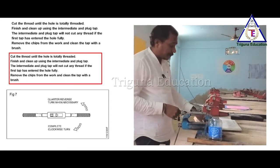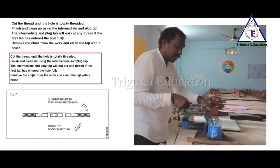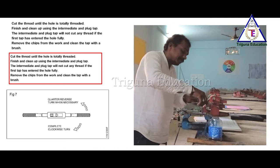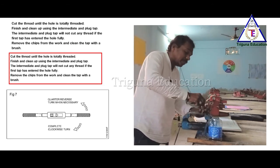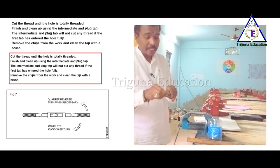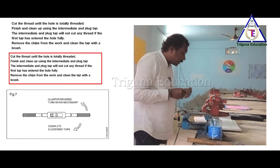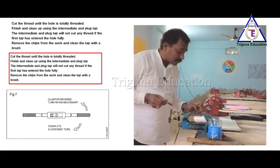The total through hole is reached to the end. Next, we apply the intermediate tap. The intermediate tap will not cut a new thread form from scratch — if the taper tap has fully entered the hole, the intermediate tap will already find a formed thread.